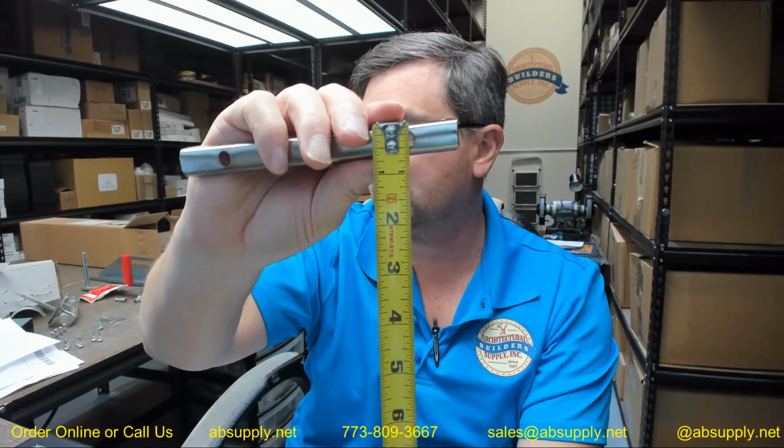So there is a link below this video to a document called Template. Let's go over the dimensional properties first. There's a U-shaped channel. That is the door portion. That's where the 6 comes in. Now, it's not quite 6, but it's close, about 5 7/8. Has an overall width of about 5/8, even though the template calls out 9/16.